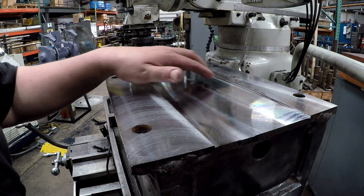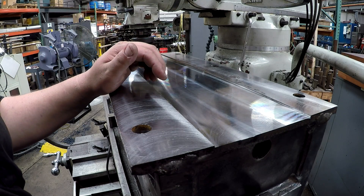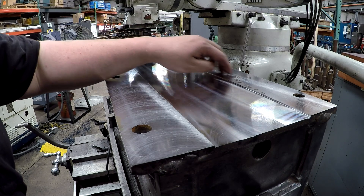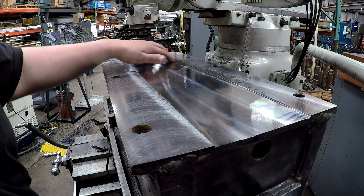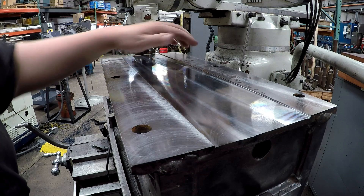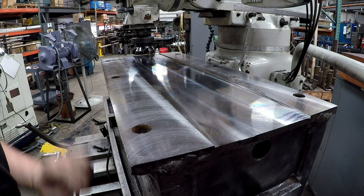I think we got the middle of it finally done. It looks really good. I ended up having to rotate the inserts one time — the rusting and pitting was really playing hell on it. That turned out good. We're going to go ahead and move over and take another 10 thousandths off of each side right here, and maybe that will clean it up.